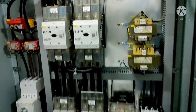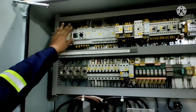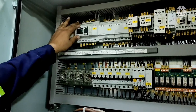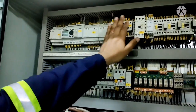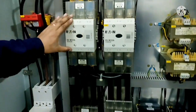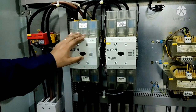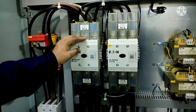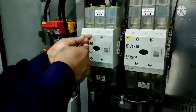In the starter, it is operated with PLC control. This is the PLC input and PLC output. These are the auxiliary contacts and controls — main contactors for operating the mooring winch. We have to first open the contactors and clean the contact points. I will explain how we open the contactors and take out the contacts, starting with K1.